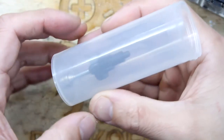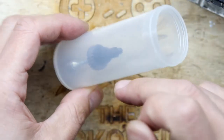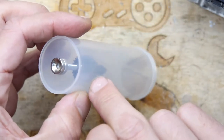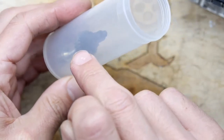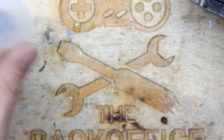You can see it's entirely held rigidly by that magnet and it's centralized beautifully. Even if I shake it or wobble it, it's not moving. I'm going to have to be a bit careful when I pour — I might pour it at a slight angle to make sure no air bubbles get trapped under there, because we don't want any trapped. I might pour it at an angle and then once it's past that point I'll gradually turn it and finish the pour. So I'm going to mix up some silicone and fill this up to the brim.